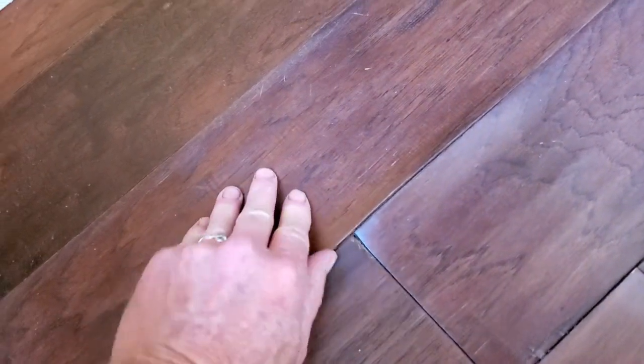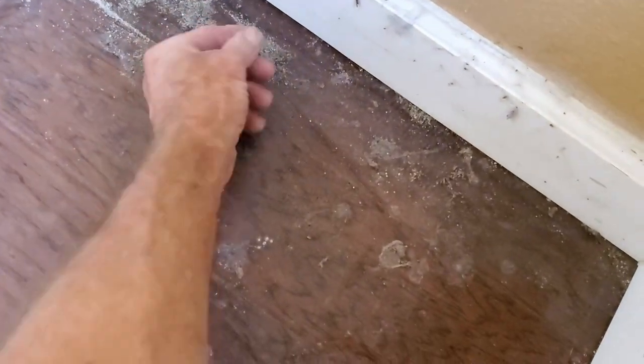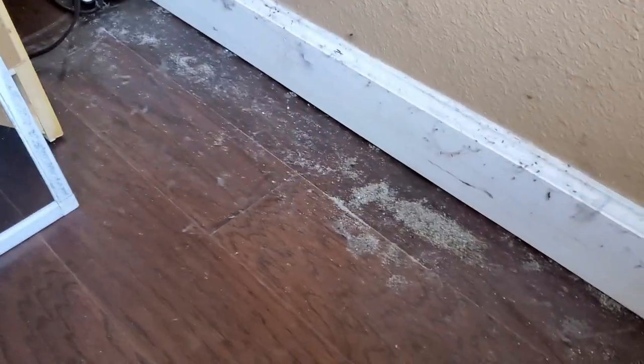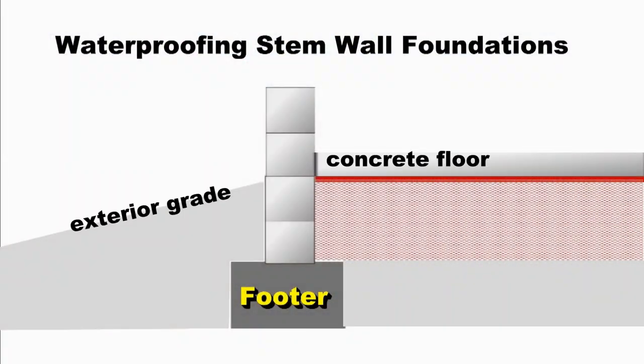Take a look — you see that sand in the corner? Look at the hardwood floor buckling. This is water damage: water under the floor causing that hardwood to buckle. There's so much pressure that between the wall and the floor, it pushes the sand up. Can you see that? Look at all that sand — that's from water pressure. Even though it's 16 inches above grade, water still comes up.